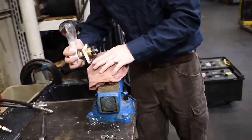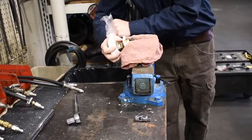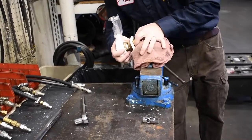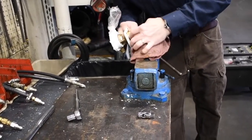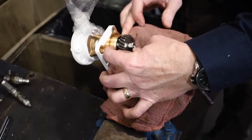Finish tightening the nut in the vise using 20 to 21 foot-pounds of torque. Be certain that you clamp only on the hardened gear — clamping onto the brass body will produce soft points that can fail.